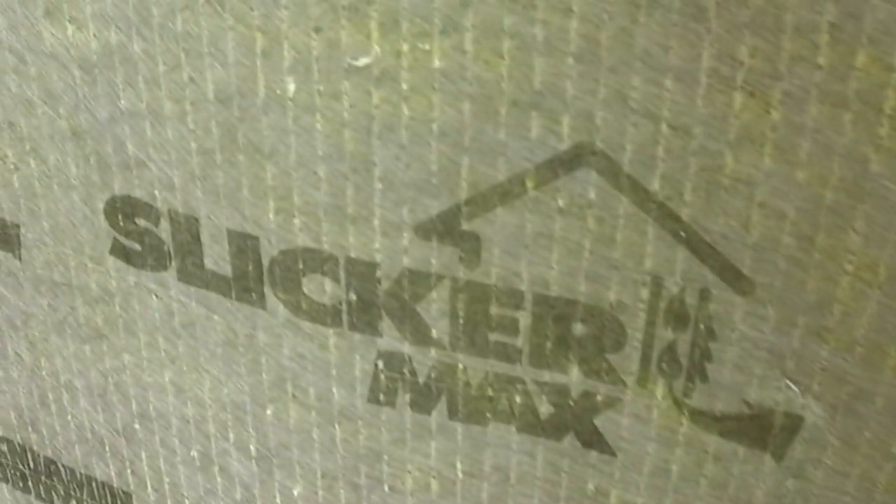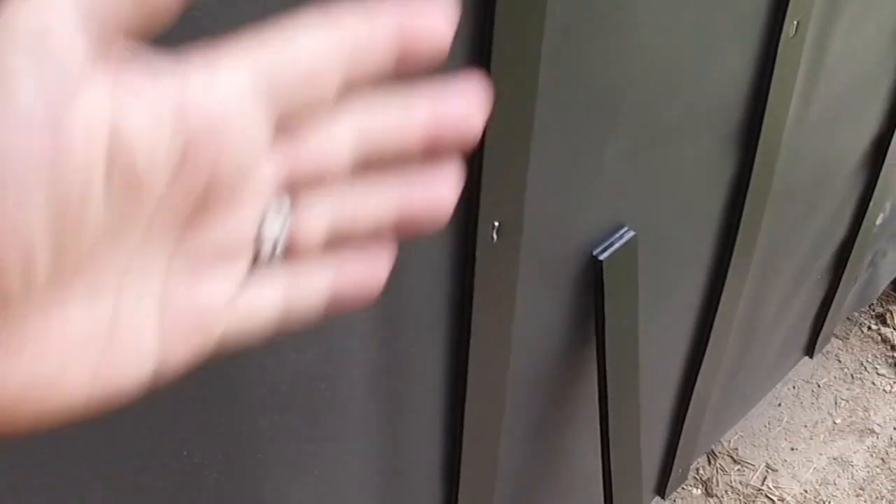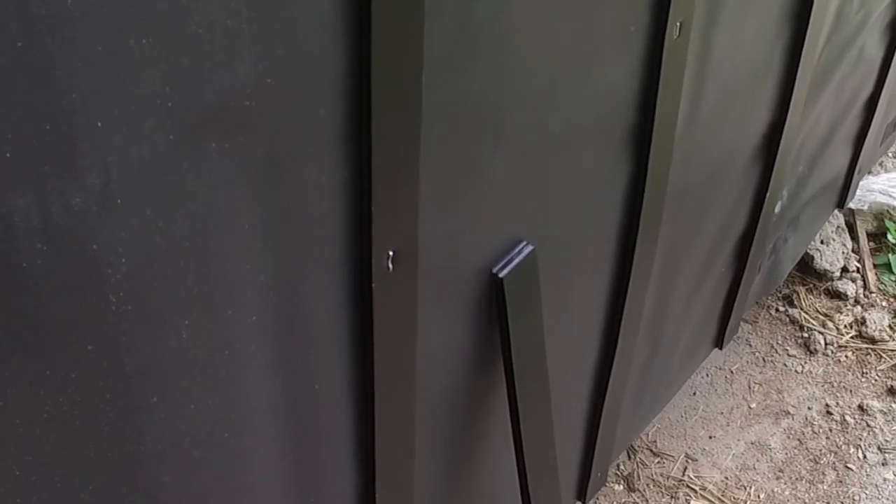I'm in favor of either using something like this entangled matrix type system that allows air to flow every direction — it's really hard to ever cut it off because it runs behind everything and you don't have to monkey around with individual furring strips. And if you have to do furring strips, something like these core-vented Batten UV battens that allow air to move through the system horizontally and vertically, reducing the likelihood that you'll stop the airflow, create a bottleneck, and not get the ventilated rain screen action you're looking for.